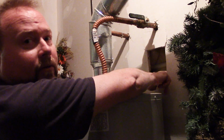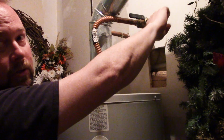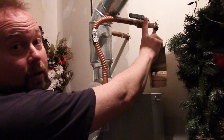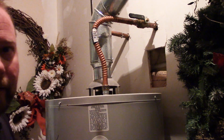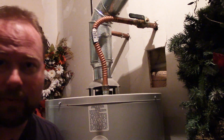I happen to have it in this hole here in the wall. It's another valve, looks just like this, a quarter turn. You just turn the handle a quarter turn. So when the handle is facing the same direction as the pipe, it's on. And when it's 90 degrees, adjacent there, it's off. So I've got the same thing stuck here in the wall. It might be running on the wall on the outside of it, behind it. Very popular places for it.